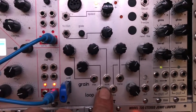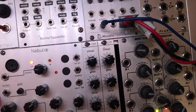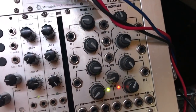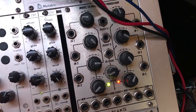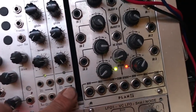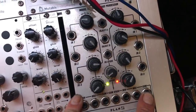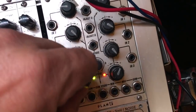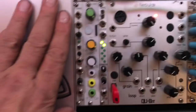These are my two Nebulae — I do a lot of processing of found sound and vocals and I need those. Two single voltage processors with glide, and my Plan B Model 17 dual voltage processor. Each has a sum, min, and max voltage output, and there's a crossfader in the middle that crossfades the sum outputs of the two by default, or you can insert internal signals. It's a real Swiss Army knife. There are bipolar attenuators throughout. You can use it for audio, but you've got to be careful because you can send things against the rail due to the offset in the output.